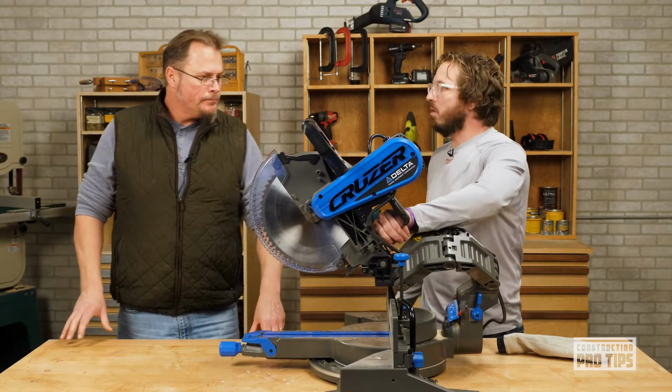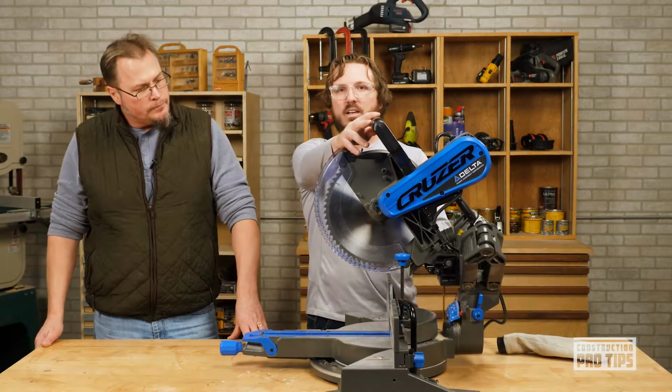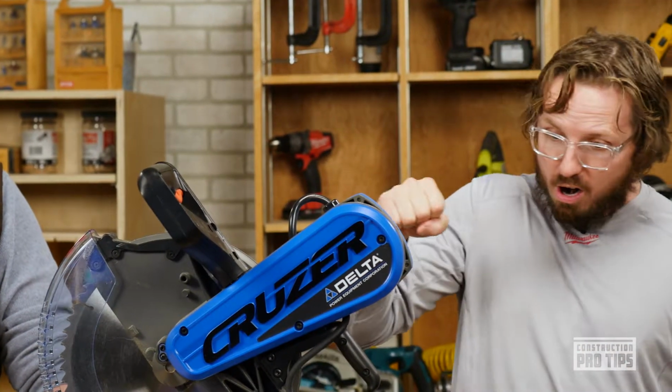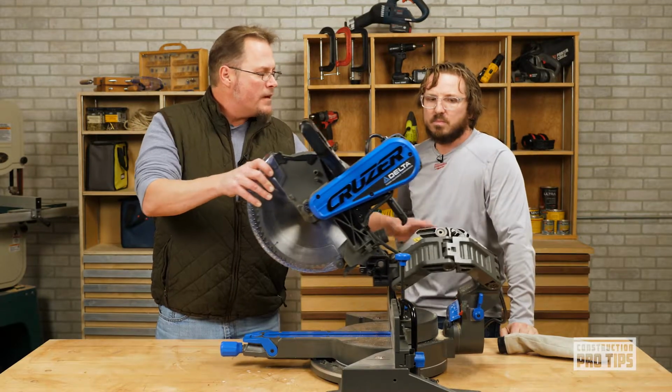It's got a 1.5 inch port on it for the vacuum, so you can actually hook the vacuum up to it. On the vertical cut, it's got 7.5 inches, which is super cool. It's got a slow ramp up on the start. It just eases into it, but it's still not slow enough to bore you while you're standing around. And it's got a brake on it, so it brakes as you shut it down. This is smooth, but you can actually adjust this, right?